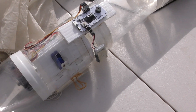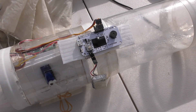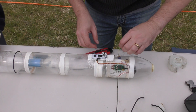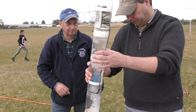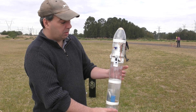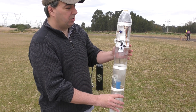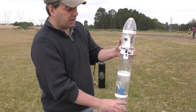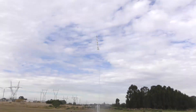Since the two test flights were successful, we connected the flight computer to the deploy mechanism servo motor so that the flight computer could now deploy the parachute. We also removed the camera just in case there was a crash — we didn't want it to get damaged. You'd normally want to mount this on the inside of the nose cone, but sometimes a quick solution is the quickest. We did a quick test in timer mode to make sure the flight computer was correctly configured to move the servo in the right direction. For the actual test flight we decided to go with the auto apogee detection mode, and as you can see the parachute opened just past apogee as expected. So that was the third successful flight.